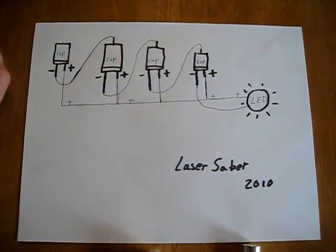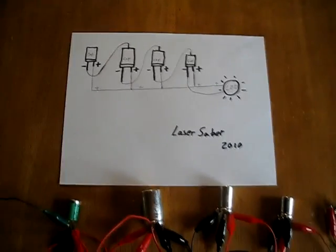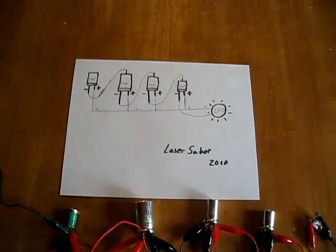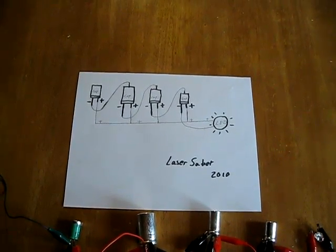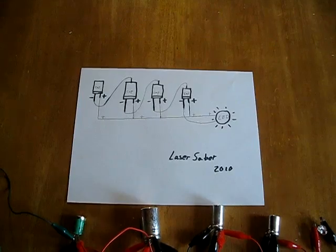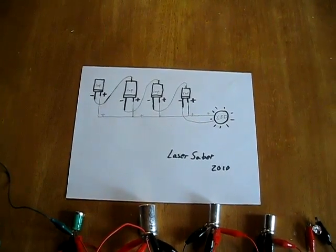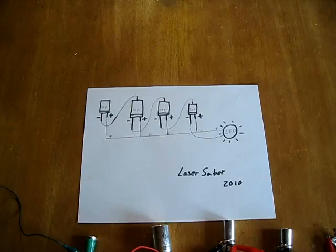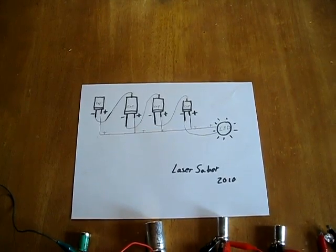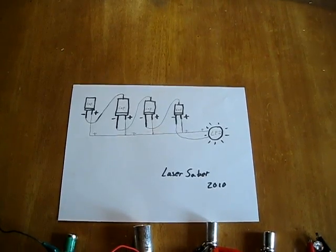I'm not ready to make any statements on what's going on there yet because I have to do a lot more tests. The tests I'm doing - I set it up in the morning, go to work, come back in the evening, take my readings, and test again. I've got two identical supercapacitors, and it's really confusing because I tested the self-charge rate after leaving them shorted for 12 hours or so, and the two identical supercapacitors self-charge themselves up at different speeds. So there are a lot of variables even with working with a supercapacitor.